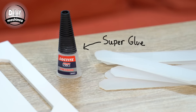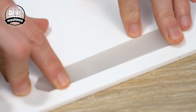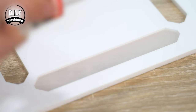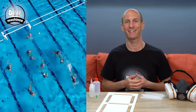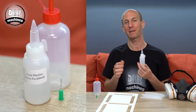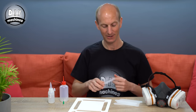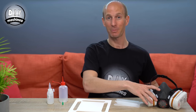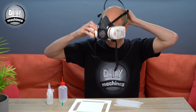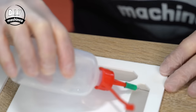To fit the inlays we can simply glue them into place flush with the front of the acrylic sheet. Super glue from the reverse side will do fine for most applications where the acrylic will not be put under any particular physical stresses. As this clock will be going up poolside it's likely to be hit by balls during water polo matches, so I'm going to be using some ExtruFix to chemically weld the acrylic inserts to the acrylic frame. Make sure you read the safety sheet — ExtruFix is very good at its job but it's also fairly nasty stuff. To use it properly you'll need your acrylic pieces to be fitted tightly and then run a small bead along the edges using a wide bore needle.